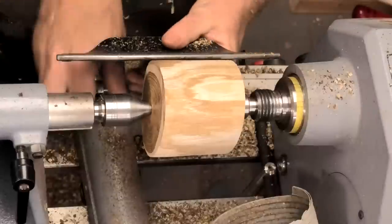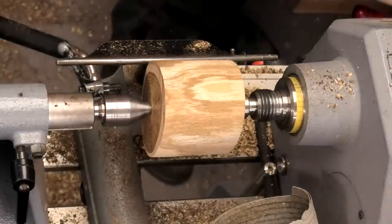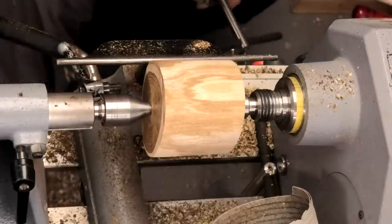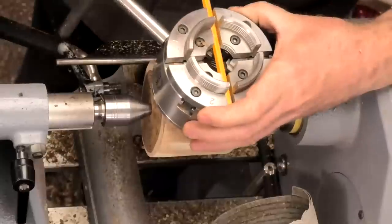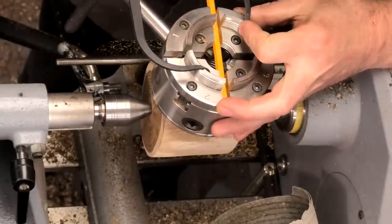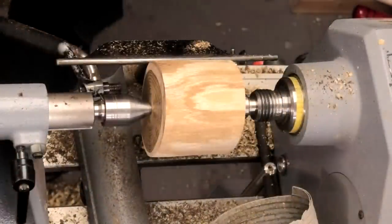I think we're pretty round. Did that up — kept most of our white out. That looks really good. We want that beautiful contrast. We need a set of ring calipers, chuck, pencil. Let's put that pencil in there — that gives me a good diameter to work to. We're aiming for a true circle. I've got a set of serrated gripper jaws so they're going to bite in a little bit more, give me a bit more grip. We then need a beading tool.